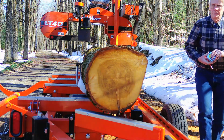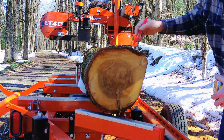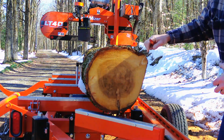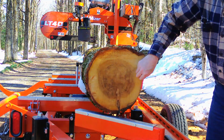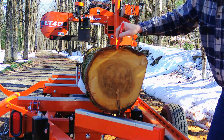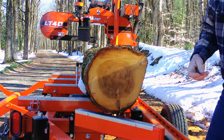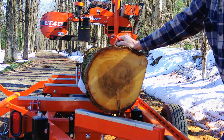Okay, I'm going to be cutting 4/4 material out of this. And what I want to do is a good milling job, as far as I'm concerned, is where I end up with 4 slabs, good usable lumber, and a little bit of edging, and that's all. Nothing where you've cut a slab up here and then you had to cut down here to get more boards and so on and so forth. So whatever I can get out of here, I'm going to.